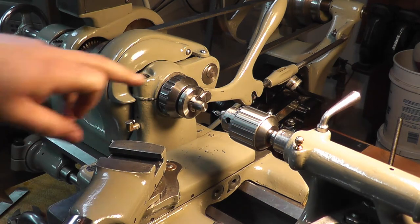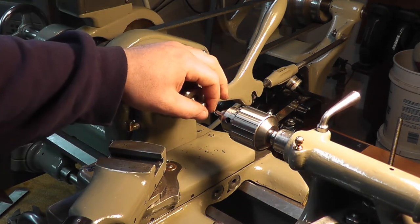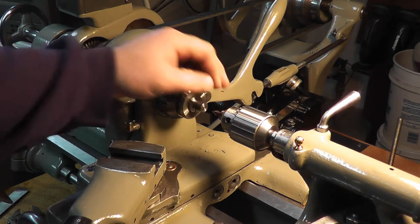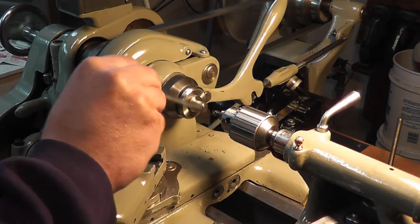and this is going to be a 5/16 24 thread on the barrel, and that requires an I. Let me double check my little chart. 5/16 24, an I drill bit for the tap. So center drill first.